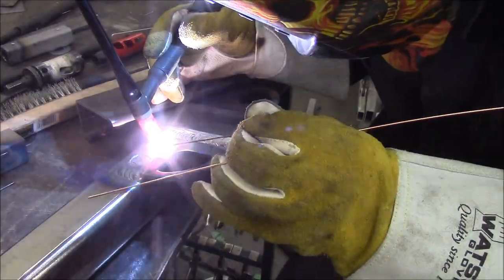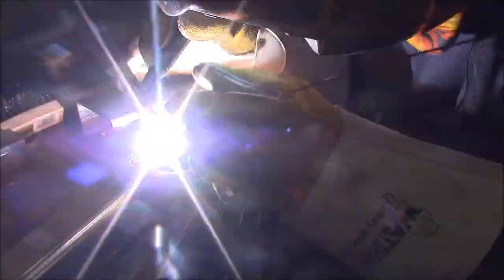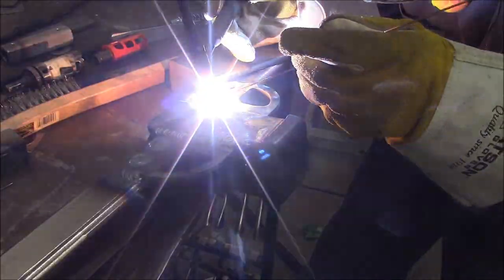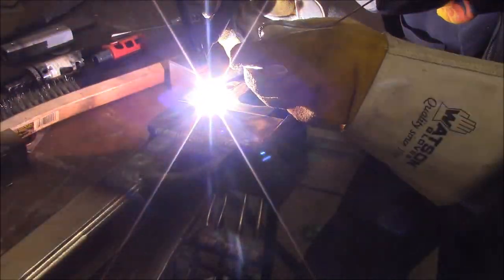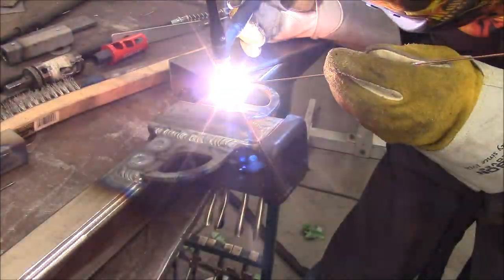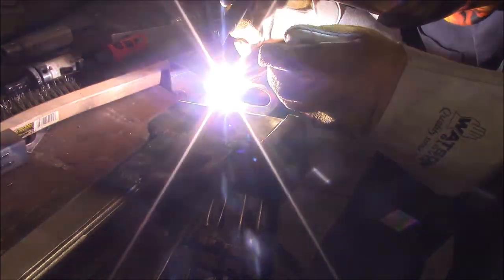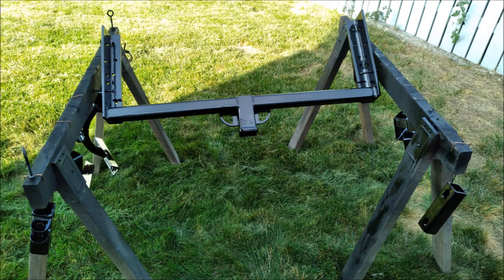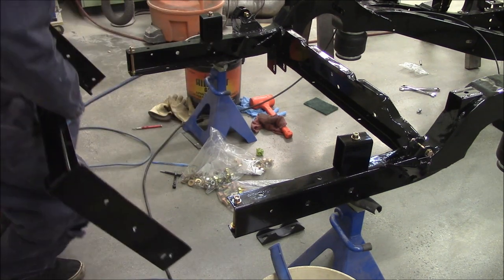However, I do see a lot of kind of gross looking hitches where the trailer hitch got chips in the powder coating, and then moisture got in behind the powder coating and rotted everything else out. So I'm not convinced I really want powder coating. I'm not sure how it bites into the metal. Paint tends to bite into the metal, and I think it'll slow things down. So I sprayed a coat of 2K epoxy primer all over the whole thing, followed by two coats of urethane enamel. Three components to it, I guess.